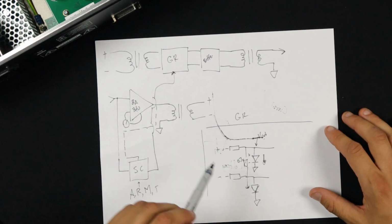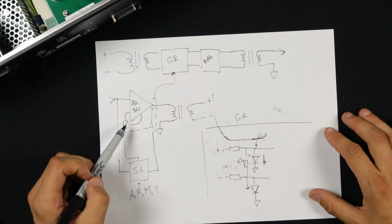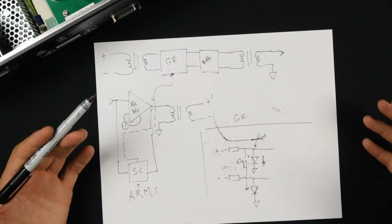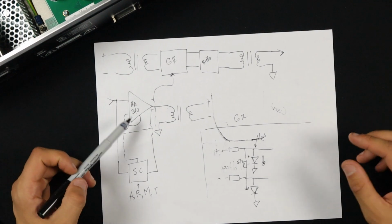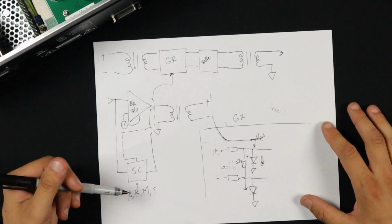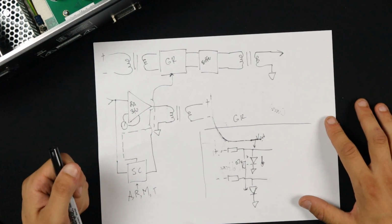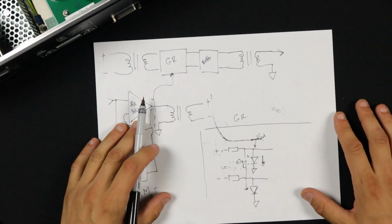What else? I mean, since you need to be at such a small signal level here, it means you need more makeup gain here. And so the makeup gain is going to be very important to the sound. And here we have the BA340, Neve's Class AB sound. So that's a big part of the sound of this unit is the makeup gain. But again, those things are kind of true of FET and opto compressors as well. So you really can overstate the differences between different compression types. So yeah, that's the 3630 in a nutshell.